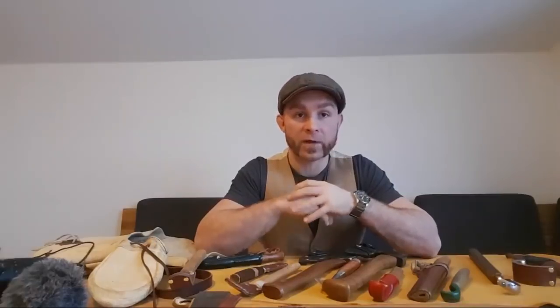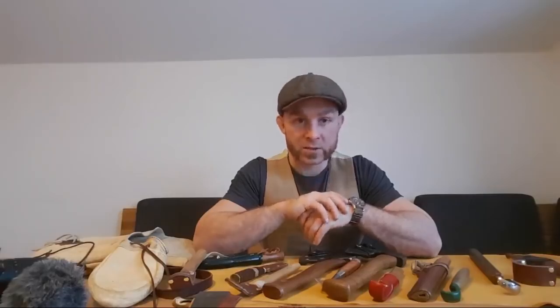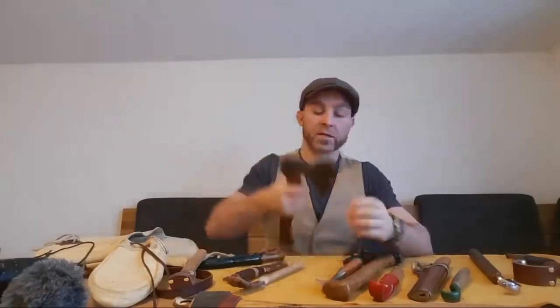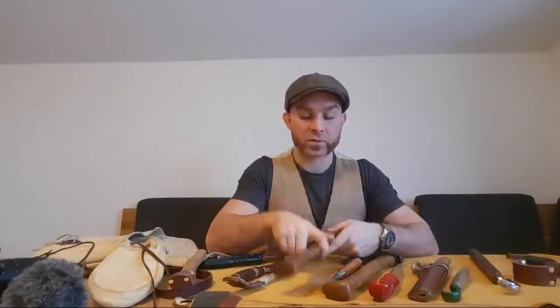There's also a video I've done about what type, size, and weight of axe to use. I think you should use the heaviest axe that you can still comfortably and efficiently work with, because the axe is first of all carving for you, and second of all it's going to help you with the aiming process. A heavier axe is more forgiving — just like in archery, a heavier arrow is more forgiving because it's just going to be harder to move. With a heavier axe, whatever mistakes you make side to side, the axe just goes with gravity, and it's harder to make mistakes left or right, which is usually the problem with the axe getting too far into the spoon.